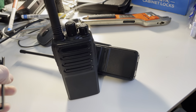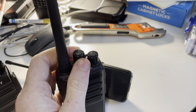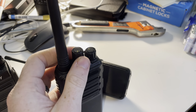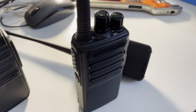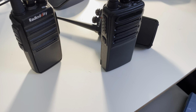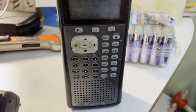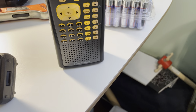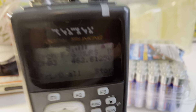Now let's see if these radios talk to each other. We're on a channel — one, two, three. Radio check, one two three four five. You can see channel 3 FRS 3, and there's the tone 167.9 Hz that we programmed in. Radio check, one two three four five.